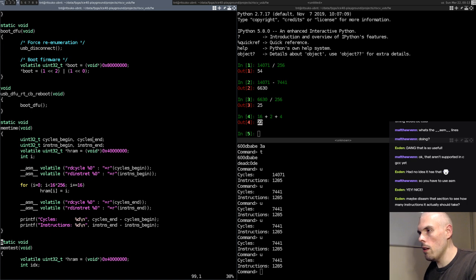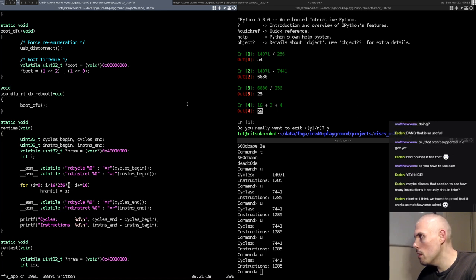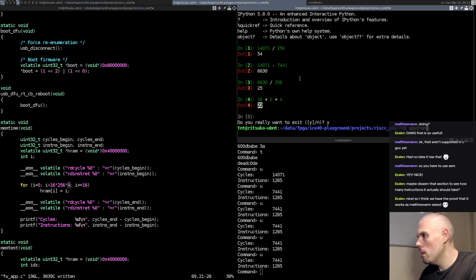That's nice. So let's try now with multiple accesses to different ways. Here we basically fetch one cache line per way. If I do times 4, this should basically load every single way, because we will have cache line conflicts and it should load them in different ways, which means we should still see about the same gain. Of course it's going to be 4 times as long because I'm accessing 4 times as much data, but the cache should still work fine. We should still see the same performance gain, that's what I mean.